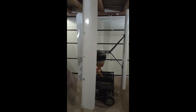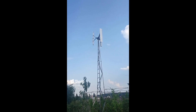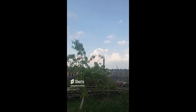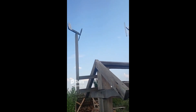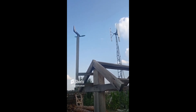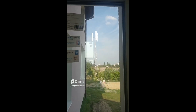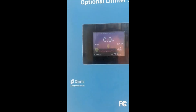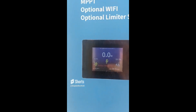Imagine the size — that's quite nice. Here it is, mounted on top. At maybe two to three meters per second wind it already rotates with some nice distinction. I have this smaller fan just for comparison, and it doesn't even try to spin. The height really matters. With this rotation I was thinking it might produce something useful. When wind dropped to around one to 1.5 meters per second it still kept rotating, and the voltage was already around 9 to 10 volts — much more than the small one was producing.